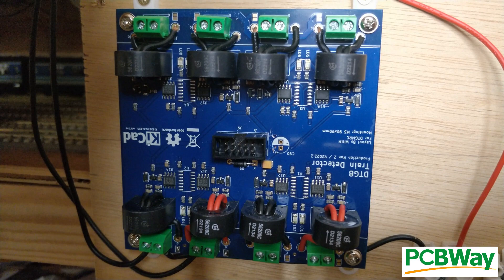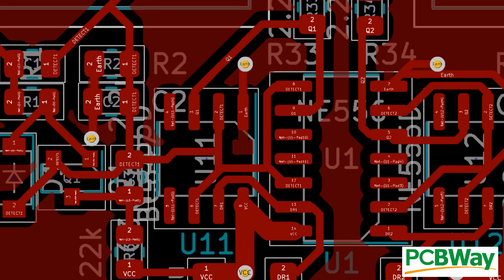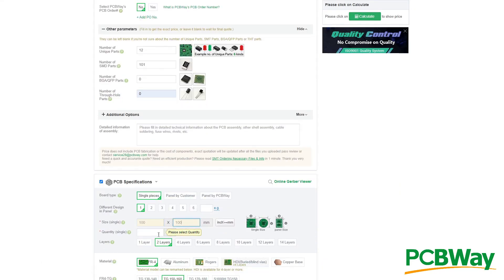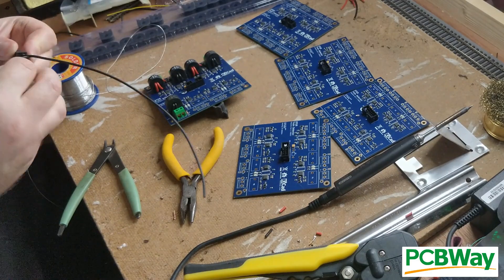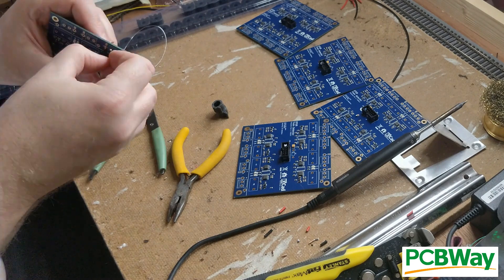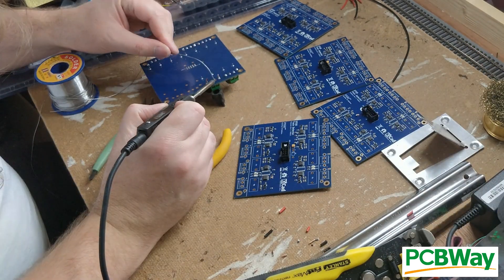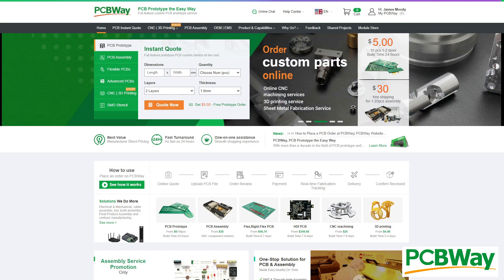This is a new iteration of the DTC board, courtesy of channel sponsor PCBWay. This is a revised version derived from the MERG design. We modified it to use mostly surface mount components. We have added power supply smoothing and reverse current protection. We have also swapped the ribbon cable socket and screw terminals for ones we prefer. I had five of these created and assembled by PCBWay using their SMT assembly service. They arrived with all the surface mount components already installed and ready to go. They still required the two turn current transformers hand wound afterwards, as these cannot be machine assembled. Having a batch of five surface mount boards assembled by PCBWay like this is an affordable way to have a small run of surface mount boards assembled. These boards will also make wiring the layout easier, as I won't have to make up quite so many odd cables to connect things with different socket types. You can learn more about making these boards in the video linked here, and sign up with PCBWay to order your own PCBs, with or without surface mount component assembly, with the link in the description below.